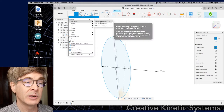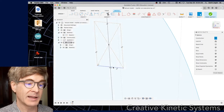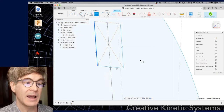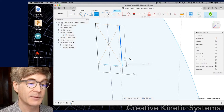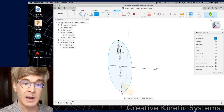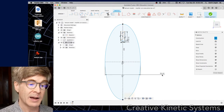I'm going to dimension it individually here rather than tie it to anything. So dimension the width at 6.2 as we've been doing, dimension the length at 15, and zoom back out. Also if you click on faces of the little view box, you can jump immediately to different viewpoints — that's actually very convenient.